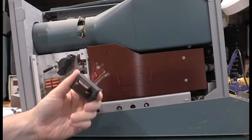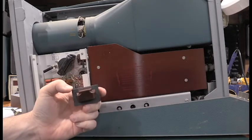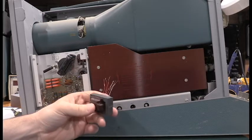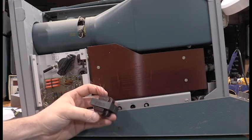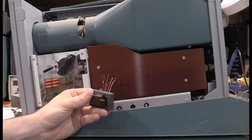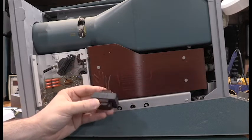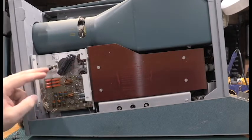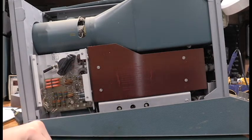That's a sore spot, but you cannot find these transformers. One of the guys on the Techscope forums actually made a new one — had a modern one commissioned. I haven't tested that yet, but I did buy a couple because I really want one of these curve tracers for the lab. If you need the T850, you will not be able to find it. From all the research I've done, this black rubber potted transformer doesn't have the same leakage problems as the epoxy potted one.